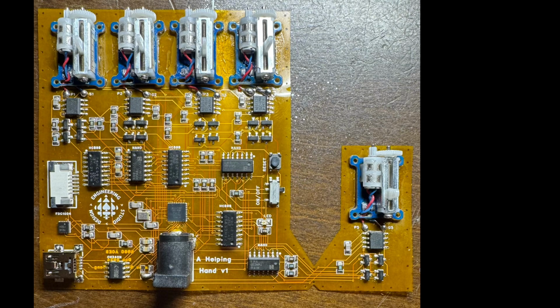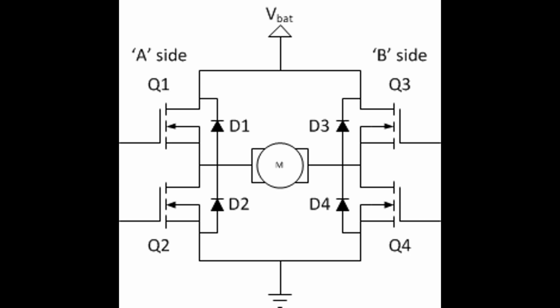To power each motor, the ATmega really outputs 3 different types of data. Each motor is powered by a voltage H-bridge, which you can see up on screen, and it's described more in detail in the DER report. The H-bridge needs 4 pieces of data to determine if its 4 MOSFETs are activated or disabled. That's where the ATmega comes in.